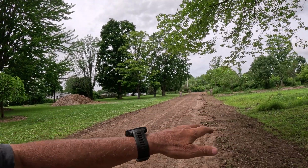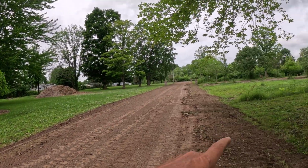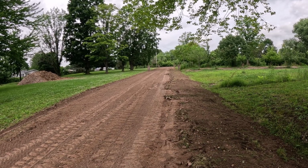Oh, and I did run Optimus Maximus, which is a Kubota Grand L 6060, with the rake behind it. I ran up the side of this, but because it has the grass chunks and pieces of sod in there, not the best. Rakes really do well if you've got pretty uniform small stuff, and the small particles can slide in between the tines of a rake. Where they really weren't, because there's a lot of topsoil and sod in here, that would plug it up and make the things flow off to the side. So I pushed it back over to this side and left as much of the gravel and sand there as possible and pulled the rocks out by hand with a rake.